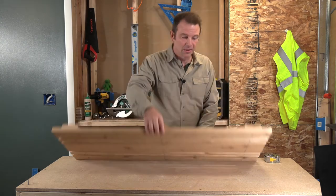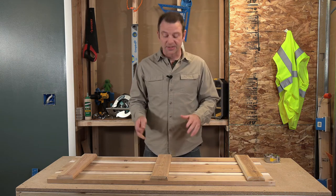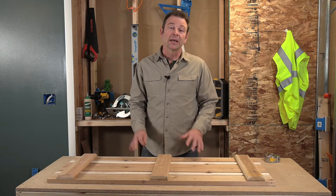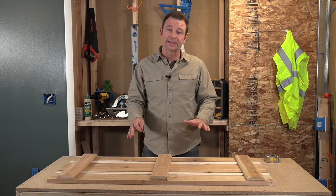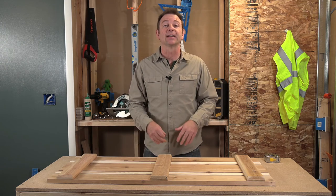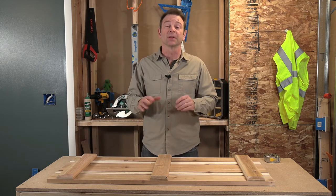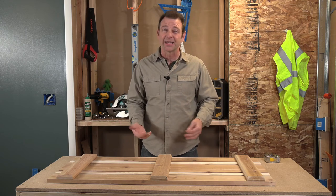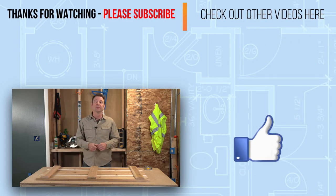Remember, if you're using screws for this purpose, make sure you don't choose one that's so long it's going to come out and show on the front. This is an inch-and-a-quarter screw, which works great for two three-quarter boards laminated together. It's time to make a shutter to match this one, and once I've got them both built, I need to finish them out. That's going to require primer on this shutter. I'll also need to spackle all of my brad holes, sand that out, and probably add some caulk on some of these joints between the horizontal and vertical pieces. Then I can add a top coat to make these look really good. This is an ornamental piece that goes on the front of the house to be seen, so we want them to look great. I hope you've enjoyed this project — it takes some simple skills, but if you take your time and are careful, this could be a great improvement to a home. Thanks for watching and good luck.